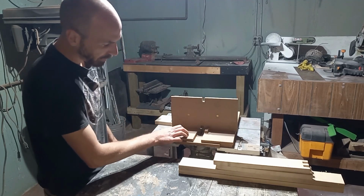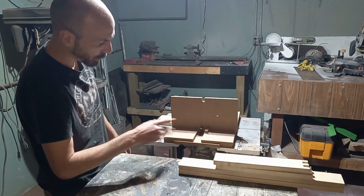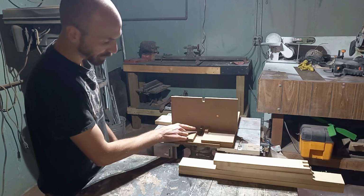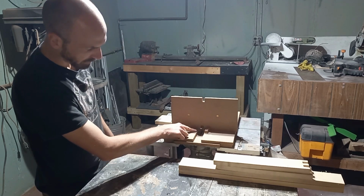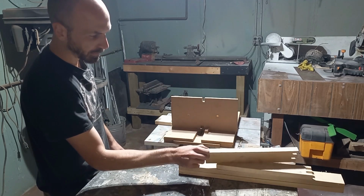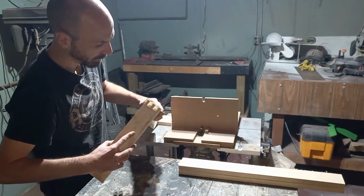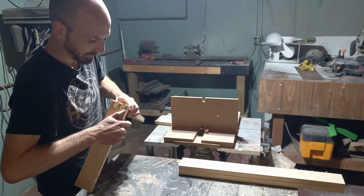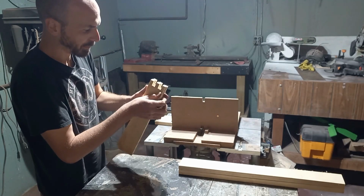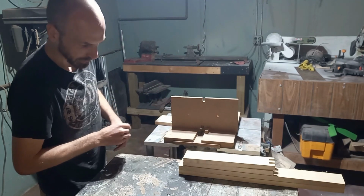Right now we have this homemade finger cutting jig thing. It's all set up with a 1/2 inch router bit, and it's 3/4 inches tall to make up for the difference in the wood thickness. So when these things cut through, it'll slide something like that then. So then we're ready to start cutting these guys out.